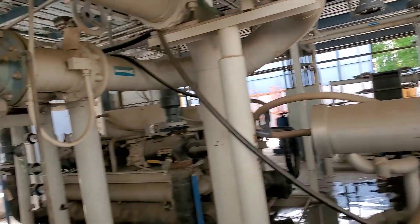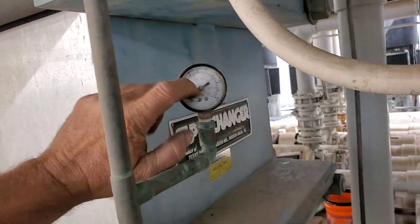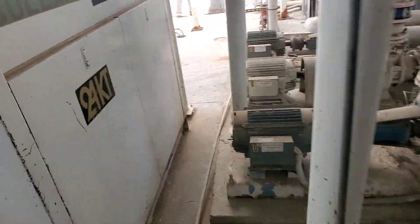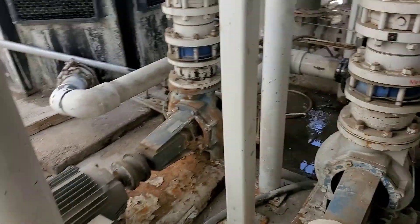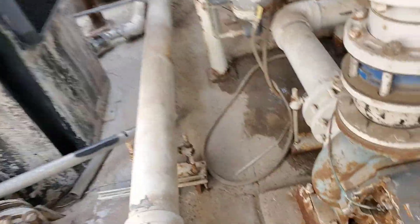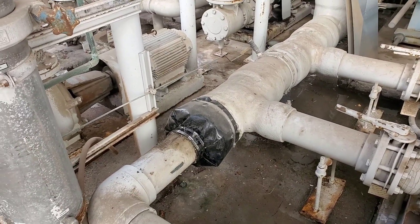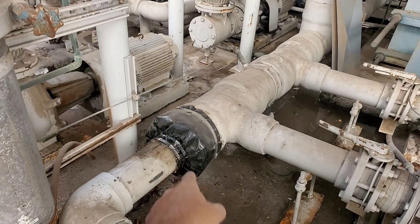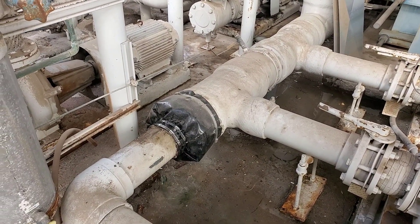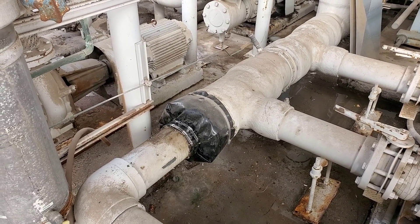There's the makeup water — I followed the water supply line over there and found out it was turned off at the backflow preventer. There's almost 8 psi on that half, which is the closed loop for the water source heat pumps inside. The other part coming from the spray nozzles — look at that — somebody's fix: a couple of those patches. It might be slowing things down a little bit. That is custom.